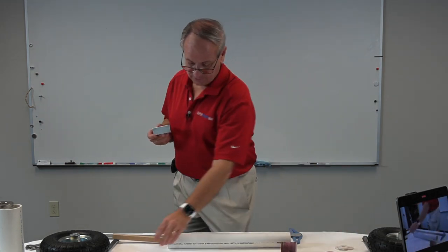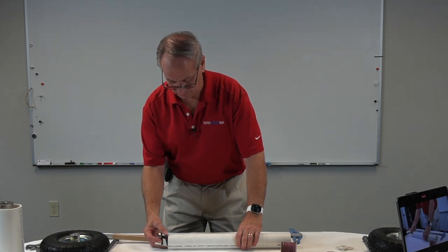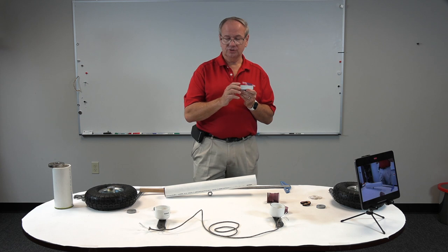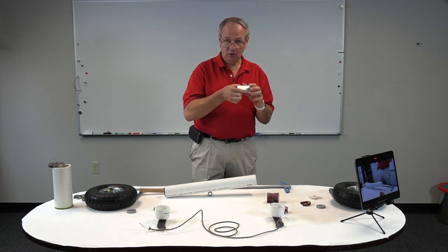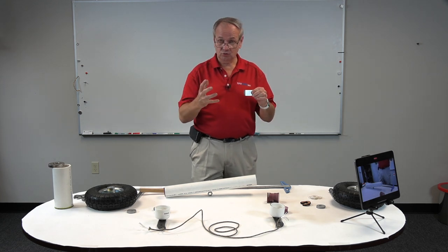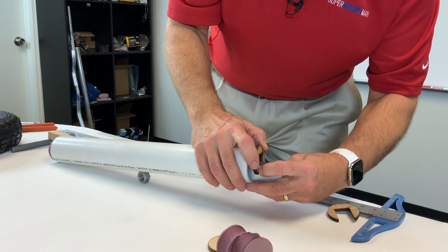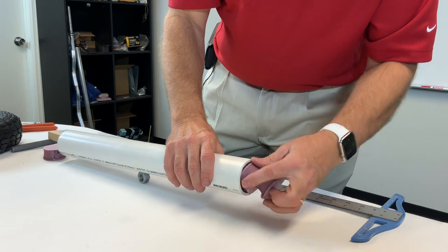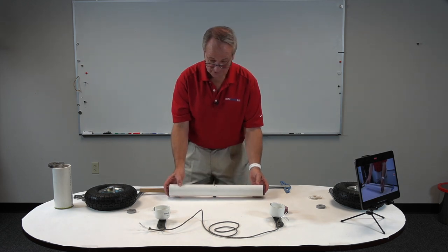Notice that I keep the magnets a long ways away from each other. My second one comes in here and you can tell it's already making that move. I'm going to line this second one up and I want it pointing down. Now I've got two in there, we're going to put the third one in. What we're trying to do is remember to put the polarity right — the one in the center has the south pole pointing down, north is pointing up. This one is going to need the north pole pointing down. That way they're going to attract each other and create a loop in between which increases our magnetic pull force. So I'm going to set it in here and put the spacers on to hold it in place. Now it pulled itself in — wood and then styrofoam on this end. We're going to center this up now.